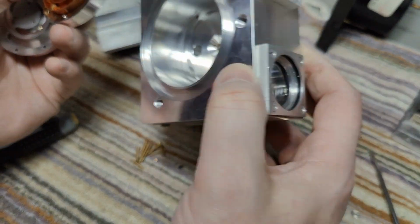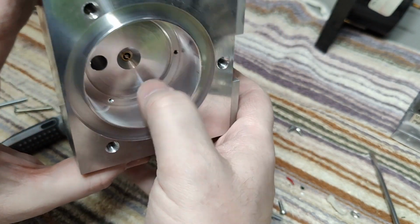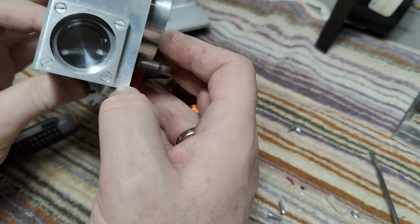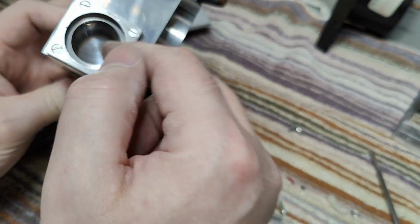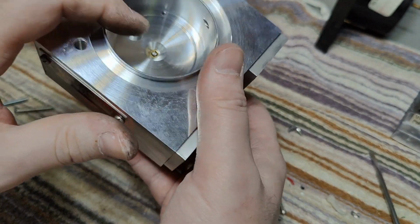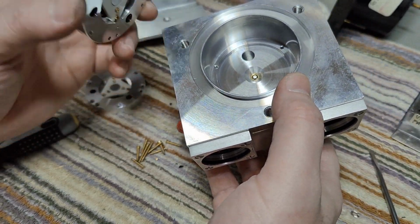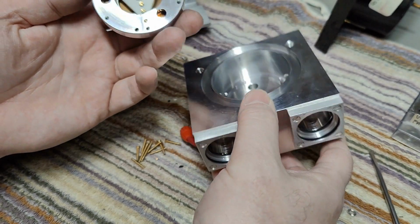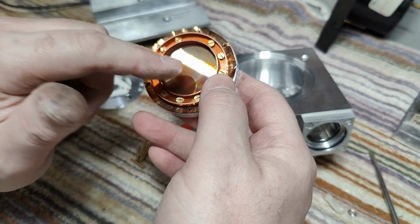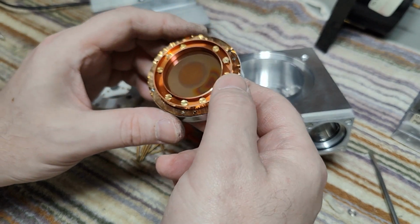And then, yeah, we got some tiny little holes here. See, here is a hole that goes to that piece, and this is completely closed. So it's light that goes into a room, and somehow you're able to create some sort of pressure difference or some magic something that can be detected using an ultra sensitive oscillator, and then this capacitor changes the oscillation frequency and stuff like that. So, how is that working? I am completely puzzled.